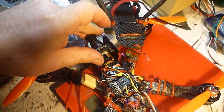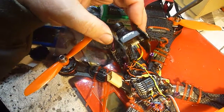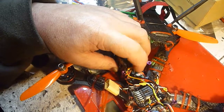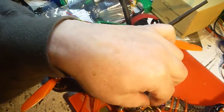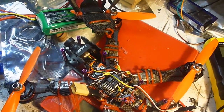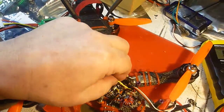I'm running this RunCam power distribution board and I'm not using a cap — it's working quite well. I get 5V from the power distribution board running the cam, and then that drops as one wire back to the VTX. I've had problems in the past running the signal cable through the power distribution board, so I haven't tried it this time. I just run the cable straight back, keeping it away from all the high voltage and high amperage.